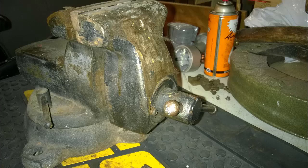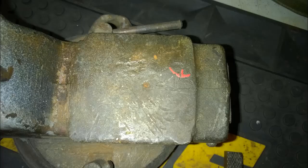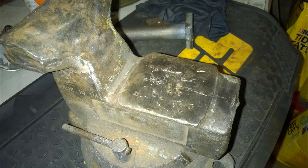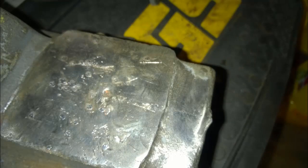When I'm done with that, I'm going to start tackling that anvil. I'm going to get my Dremel out, put a small cutoff wheel on there, and dig a small channel from where the crack begins to where it ends. Then we're just going to fill it in with the MIG welder — nothing fancy. After doing that, the anvil isn't going to be truly usable, but it's going to look so much better than it does now. Stick around.